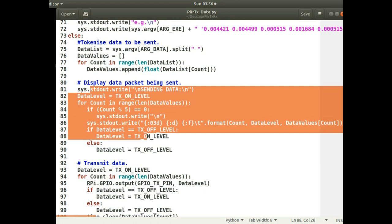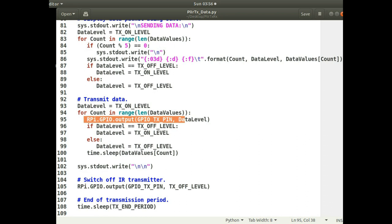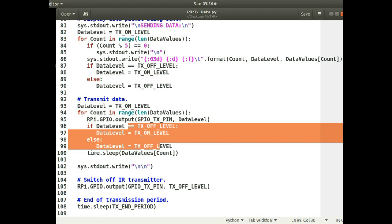It summarizes that it's sending data and goes through a loop to display it — that display loop is done separately from actually sending the data, because displaying whilst sending messes up the timing of the high and low levels. The actual transmitting loop sets the output pin to the level, swaps to the opposite level for next time, then just does a sleep passing the period data directly into the sleep command with no manipulation required. It keeps going around the loop, toggling between high and low levels and sleeping for each required period. It's much simpler than the data transmitting code in the previous video — and that's all that's required for remote control recording and replaying.